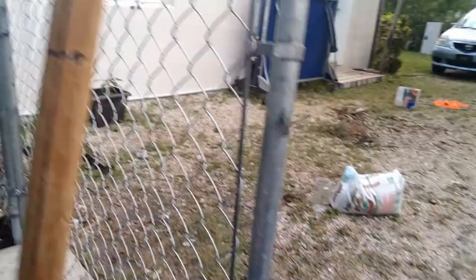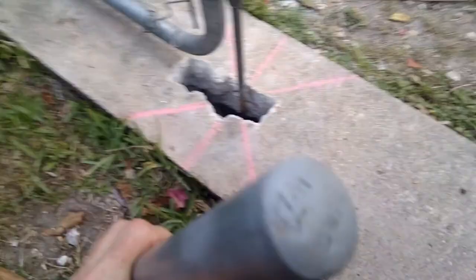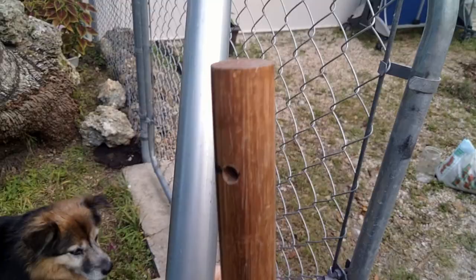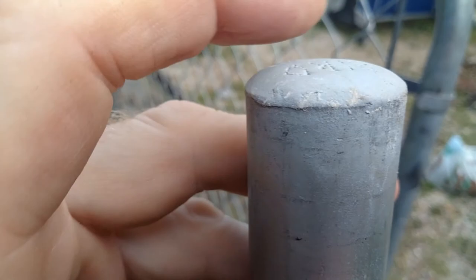I'm going to do that by using a dummy second hole so it sticks up a little higher, and I'll drop it down in there. To make these plugs consistent with a flat bottom inside the pipes, I use a dowel that barely fits inside, with a little pipe clamp to hold it at the right level. Then I put a hole in the end of it. Put a little Vaseline on the end — no comments please — any kind of release agent works fine so the putty won't stick to it. Put the epoxy putty down there and let it set.